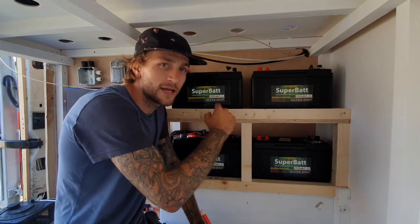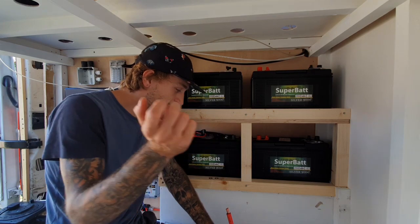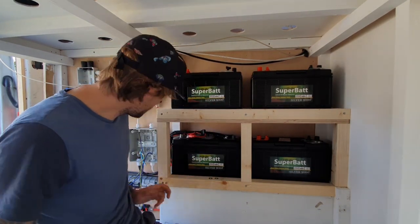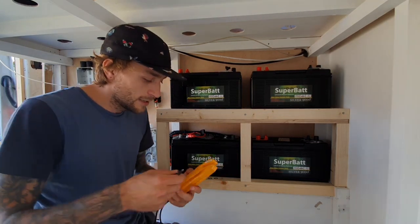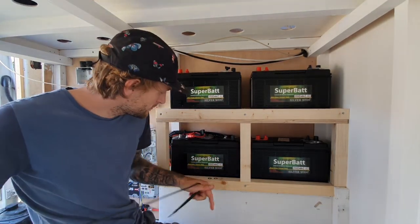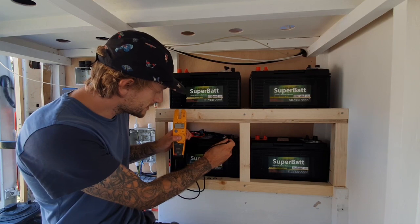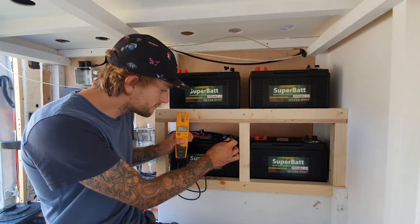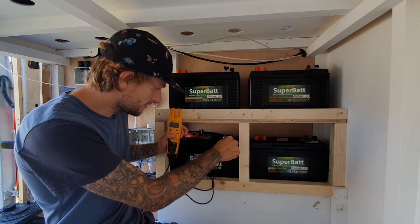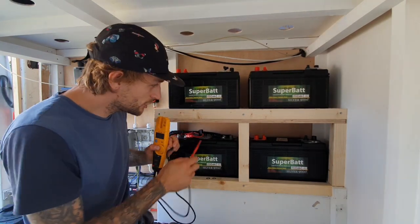As you're connecting each battery, you're effectively increasing the potential fault current. If you short them out, you risk explosion and battery acid everywhere — it can be really, really dangerous. As I've been wiring up my system and the solar system, I've been checking the polarity all the way through. Before I do any connection, I test every single cable. If you test your battery with your multimeter — positive probe on positive, negative on negative — you'll get a positive value, like plus 14 volts. If the polarity is incorrect, you'll get a minus voltage, like minus 14 volts, so you'll know it's connected wrong.